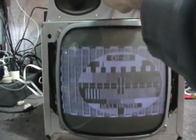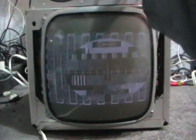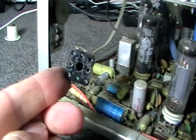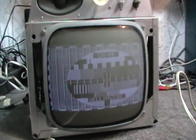There's no audio at all, whatsoever. And to top it all off, the hold control is busted — someone completely broke the slug off. I had to get in through the back and turn it with a pair of pliers to get the picture to lock, but it's not very stable. It's been jumping sideways with sync problems, which is probably why the horizontal hold control was broken to the point where the iron core broke up inside.